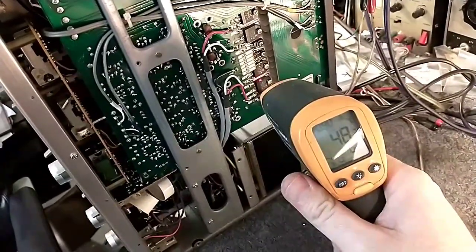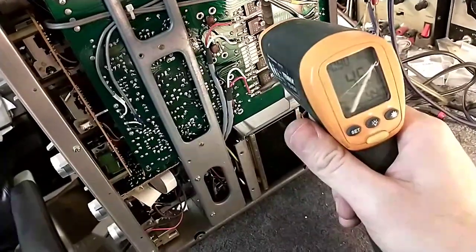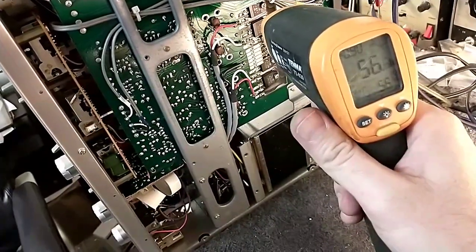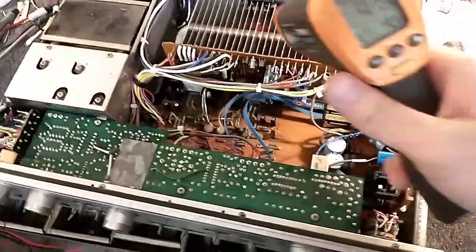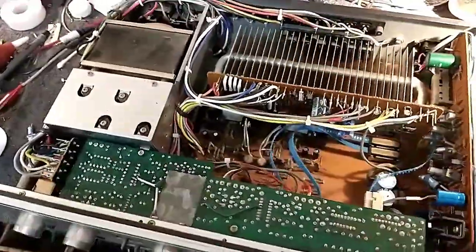About head temperature — actually the body of the transistor is hotter. 50, 54, 47, 55. This one isn't conducting very much. But when you've got 50 degrees centigrade here at the transistors, and you come back down to the heat sink and you've got 40 — that's 10 degrees, a little too much.